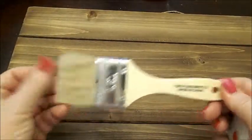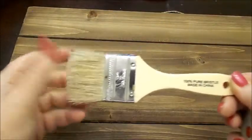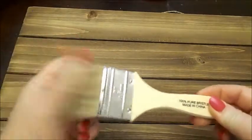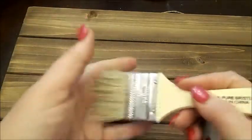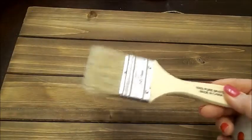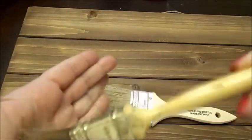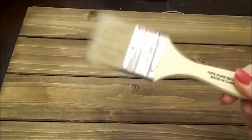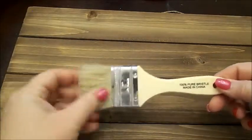You're also going to need what is called a chip brush — I call these throwaways. It's just a stiff, cheap brush. You can get them from Lowe's for about 99 cents. These are very inexpensive chip brushes. I wash them out and reuse them. If you're using water-based paints you can do that. I wouldn't recommend using these for any oil-based or outdoor stains and varnishes because they're just too hard to clean up. I also have an old Bob Ross brush here that I use sometimes — it's got softer bristles, but the chip brush will do.